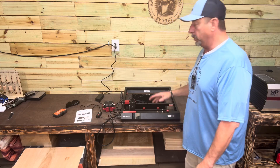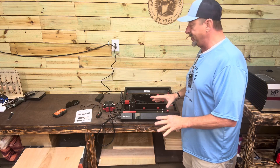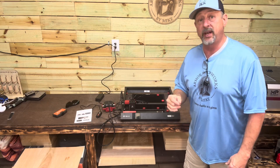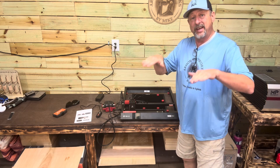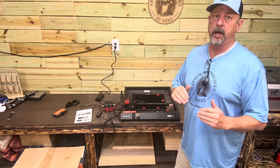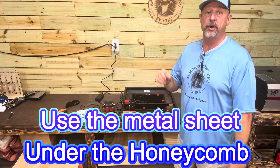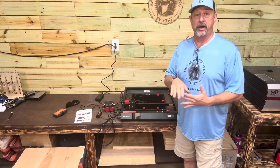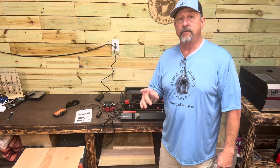We're going to pause and set it up to run some tests because it's really easy. We've already run a couple — I won't lie — just to see how it worked. I was too excited; this thing is really user friendly. Your legs on the bottom are adjustable so you can level it if your table's not level. Before you do any laser engraving, make sure you've got something under it because you don't want to burn through and catch something on fire. I've got a honeycomb — get yourself something like a thin piece of sheet metal to put under it. Safety first.